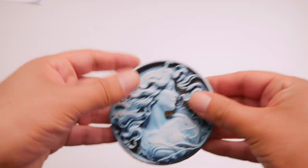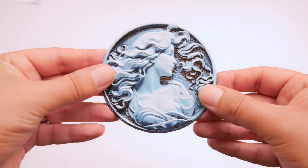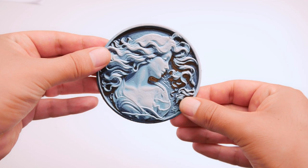While you can get really lovely prints, you can still see the contours on each layer — even going down to layer heights of less than 0.1 millimeters. For a seamless look, using a poly smooth filament smooths all the layers together and looks really nice. Chemically smooth filaments do tend to gloss and sparkle a little, which is a downside if you want a matte look. But even without poly smooth, going to as low a layer height as possible gives you a very pretty, nearly seamless effect.